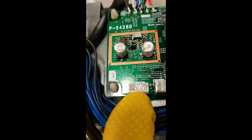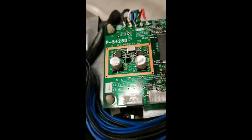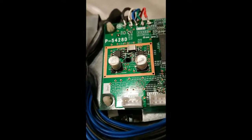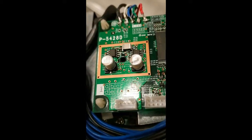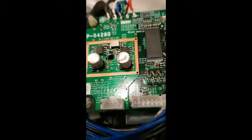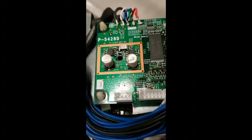So you can pull off of the ADC, you can pull off here. But if you pull off here, you're not going to be able to see what you're actually getting at the ADC unless you just back-pin probe it. But that's just something I want you to be aware of. What you get from the load cell itself gets amplified and that same signal goes to the ADC. And that's all there is to it. That's why they call it a pre-amp board — it just amplifies it for the ADC.